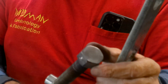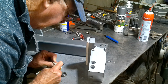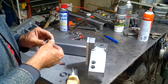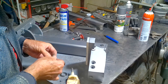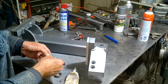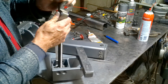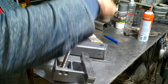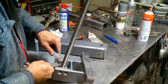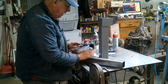Those should do nicely and the fit is pretty good, but there needs to be a receptacle inside the wrench to engage the ball detents. I think I'm approaching the final time I have to assemble this, so I want to lubricate these bearings. The stuff I've decided to use is called Never-Seize — it is a graphite grease compound, super messy, gets all over everything, but it really works well. One thing I left out of this vise was a seal for the thrust bearings, but the thrust bearings in the last vise were just fine when I took it apart.